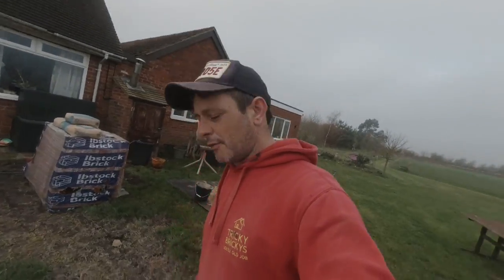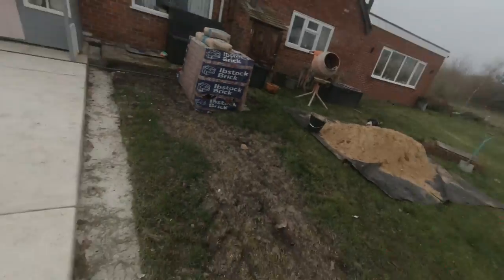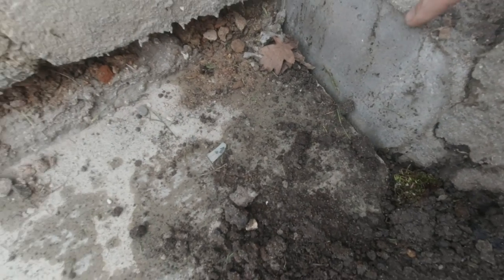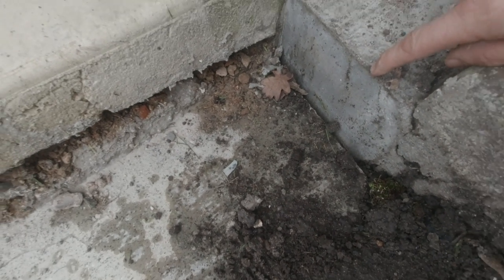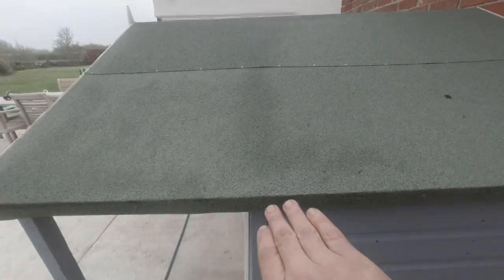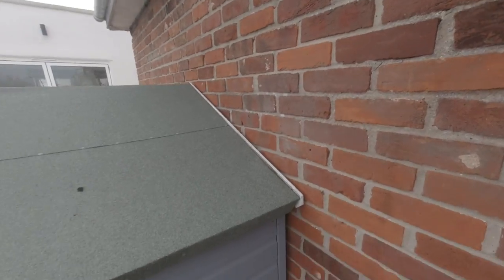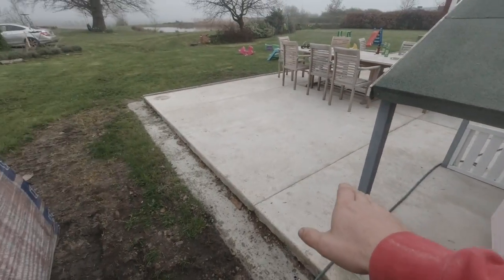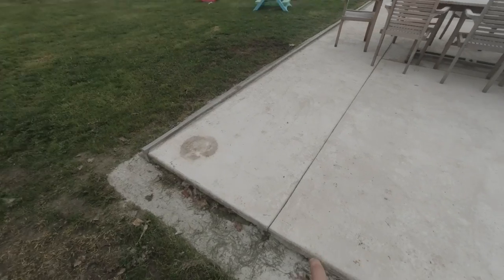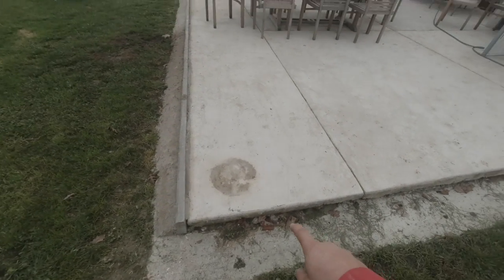So this is the job we've got here. We're down on Mersey Island and I've got a 9-inch wall to do right here. I've got one little 150 step in it, which is easy enough to sort out. And this section, just to protect this window a bit, we're going to bring up, with a bit of an angle on this bit, and then bring it down to 900 brick on edge. So it's going to be a meter from the outside, 900 from the inside.